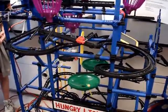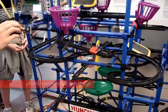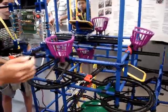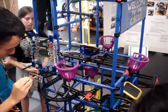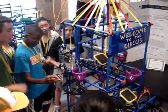One of the disadvantages of this system is that when the ball goes through the photogate, the servo motor down here for the balancer freezes. So by the time it falls down and moves out of the way, it's hard to balance — it's hard to get it to actually balance on there — but it can be done if you time it right.